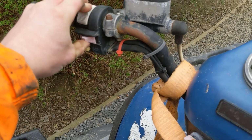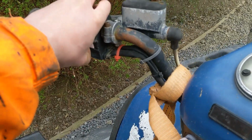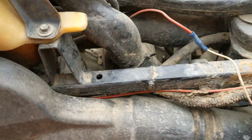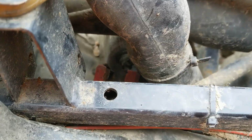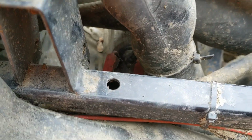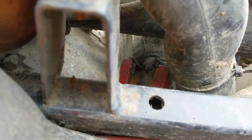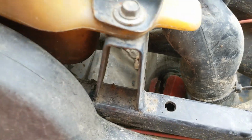Okay, let's see if it'll spin. Nothing at all. Okay, what I'm going to try now is hooking power directly to the starter. There's the starter connection down there. I've already pulled back the cover in preparation. We are getting some slight little sparks there, so there must be connection. Leave that on there. Then we'll get a separate wire, which I should have somewhere.